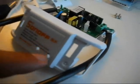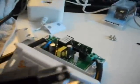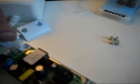A few things I want to point out when connecting this switch is that you want to make sure that you have the cover aligned correctly, so that these two holes are going to line up with the learn switch and the LED light. And you want to make sure that you have it correctly connected. You can see right here it tells you that this side is in, that side is out. So on the inside you want to have the male connection, and on the outside, outgoing side, you want to have the female connection.